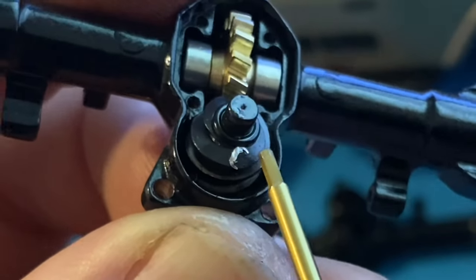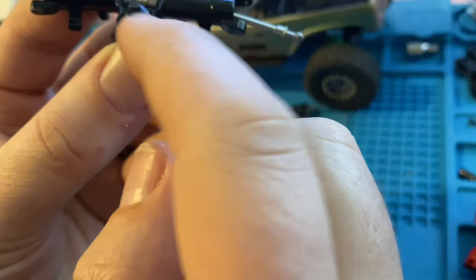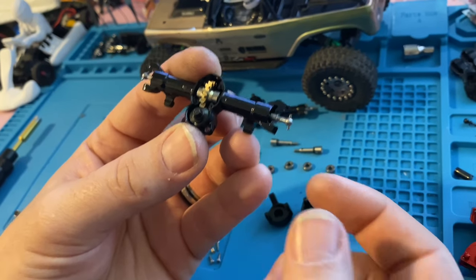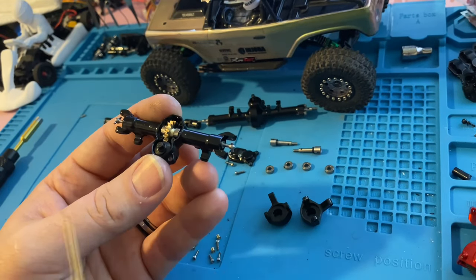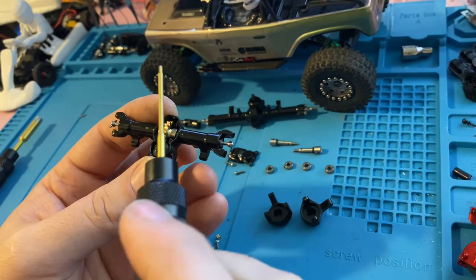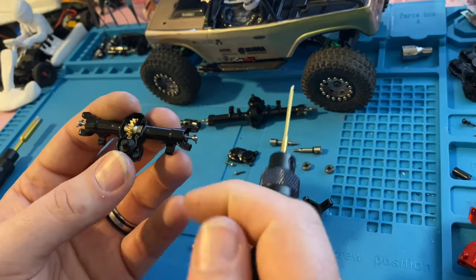There's a little bit of machining metal in here — that's not usually a good thing. That's why I'd recommend whenever you get something fully assembled, even from a reputable source, you want to disassemble it and make sure there are no flaws. If you throw an axle into a rig especially with a high-speed motor and there's binding, you could easily burn things up. Always check that everything moves freely.